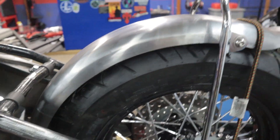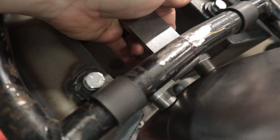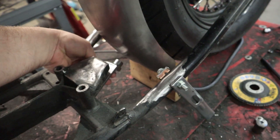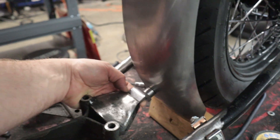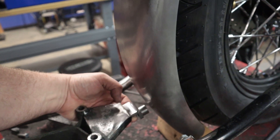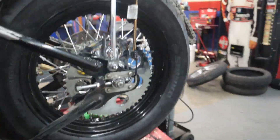So let me rip the seat off. What I'm thinking here is I have centerline marked right there. I have this mount — I'm gonna have to cut it lengthwise there, but I think this is gonna mount something like that. I have the transmission plate removed and cut off the factory mount. What I'm thinking is I will cut this, angle it upwards, and weld that on like that. With the factory mount I was gonna have to have a long spacer, which would look weird, but with a short spacer it'll look better. That's the idea for the day.